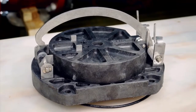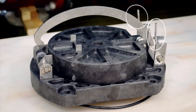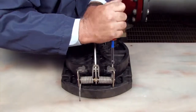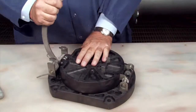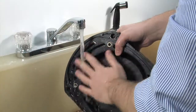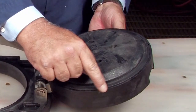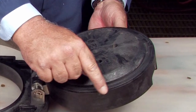To open the number 2 check, first release the tension holding the clapper shut. Locate the two cam arm torsion springs. With a 3/8 inch nut driver placed over the torsion spring, move the spring away and around the retaining bracket to release the tension. Do the same with the second spring and the cam arm will open with no tension. Clean the check with water to remove any dirt or debris, and thoroughly dry the unit before proceeding. Damage or deeply embedded debris may be invisible to the naked eye and can only be detected by close examination and touch.